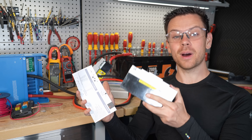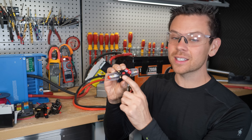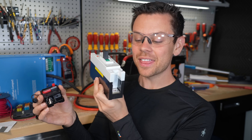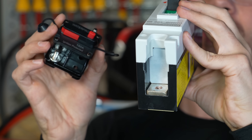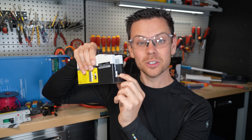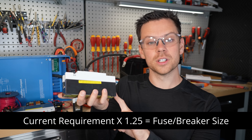Here are tips and tricks. First, any breaker or fuse you buy needs to have a data sheet — if it doesn't, don't buy it. If the breaker or fuse holder terminal is too small for the current it claims to handle, don't buy it. One rated for 150 amps with tiny terminals — that's why they melt. Compare that to one rated for 10 amps more with a massive terminal. A terminal is only as good as the connection lug, so ensure it's the proper size. Even if it's the perfect size but loose, it will still get hot — everything needs to be done perfectly.